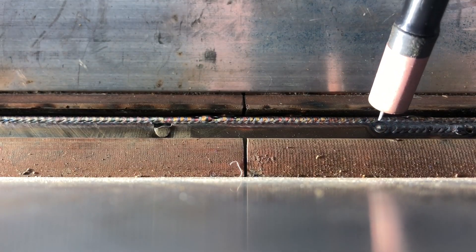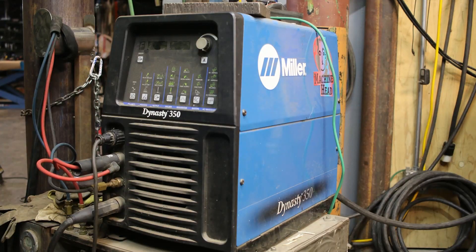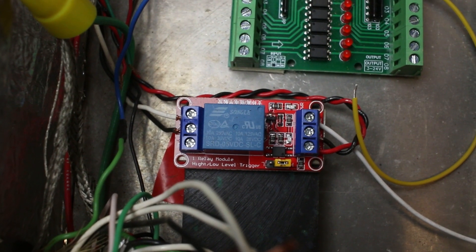When I got a hold of it, it just didn't work at all. There was a PLC in it that ran on a 10-volt logic level and the software was on an old laptop that was lost, so there was just no way to get it back. The guy I was working for told me they had lots of trouble with interference from the welder. I ended up taking everything out of the electronics box except for the power supply and the stepper driver, and replaced the relay, an opto-isolator, and the computer. The relay sends a signal to the welder to fire, and the opto-isolator was used to isolate signals from the control box, which had buttons for starting, stopping, pausing, reversing steps, and manually firing the welder.